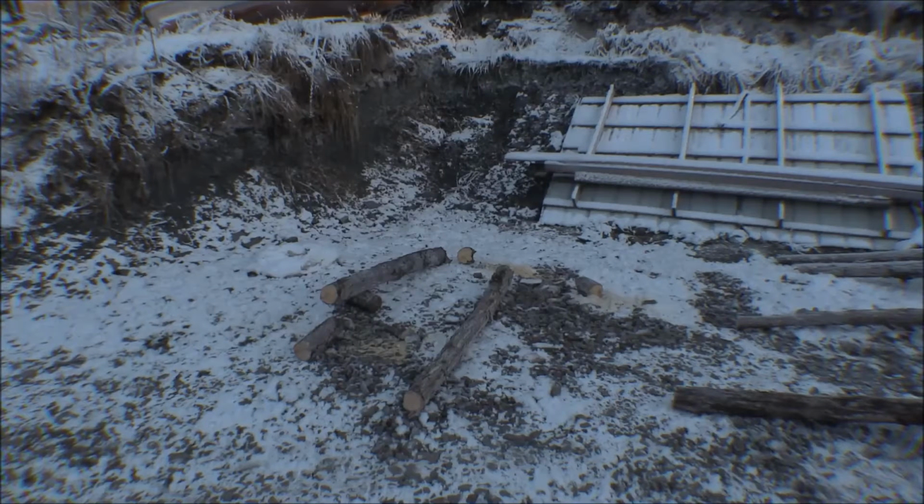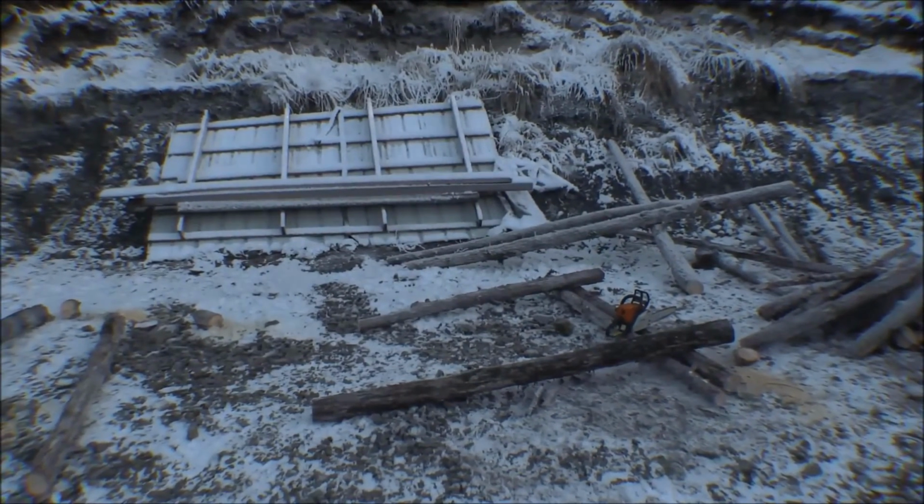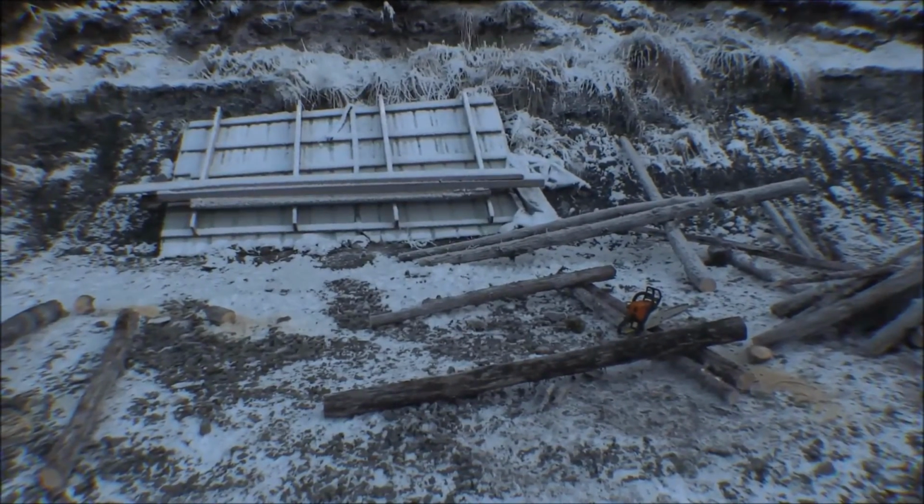This is pretty rough carpentry. I've taken one pole and cut it off to 6.5 feet. I've got another smaller one. I'm going to cut it to 5 feet. That'll give me a 1.5 foot drop on the roof. I'll make both sides identical to that the same way. Make 2 end panels. And then I cut some longer poles there that I can use for stretchers between the panels and kind of box them in.